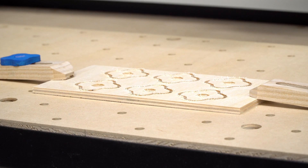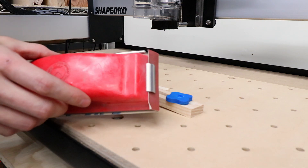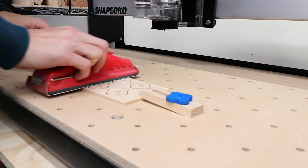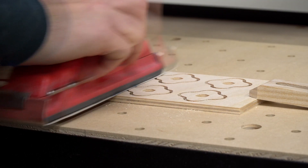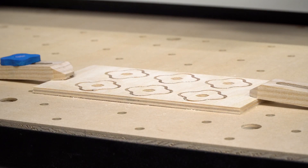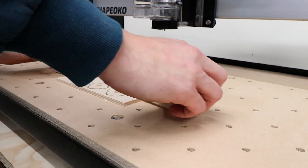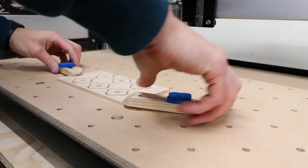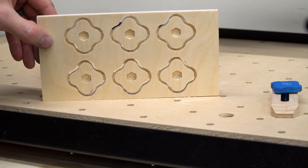There's a little bit of fuzz from the upcut tool. A quick tip to clean that up: grab a sanding block and sand it before you destock the parts. You can use your fixture ring to keep it from moving, and it's much easier than sanding each part individually.